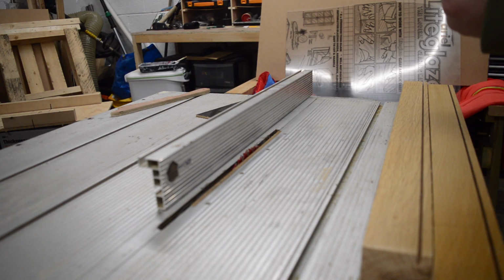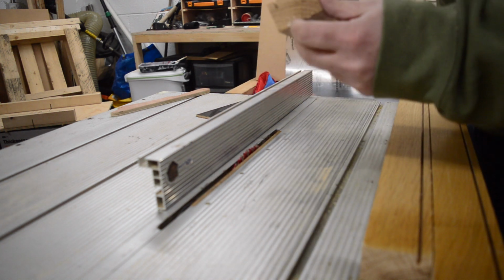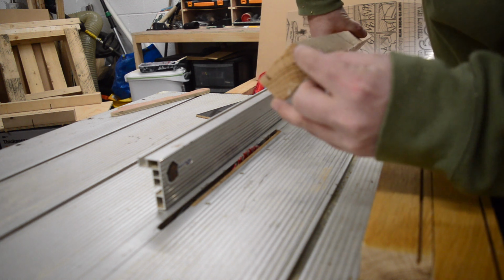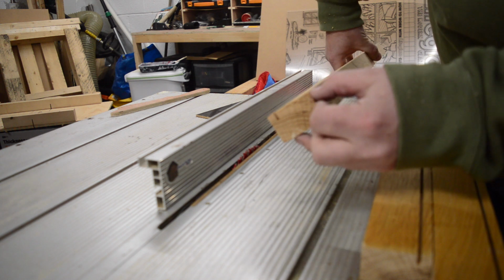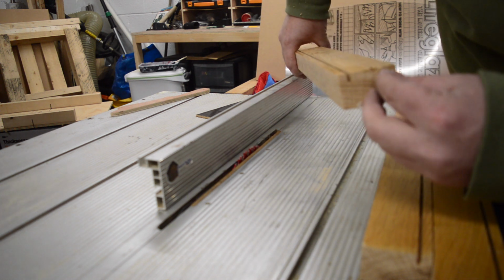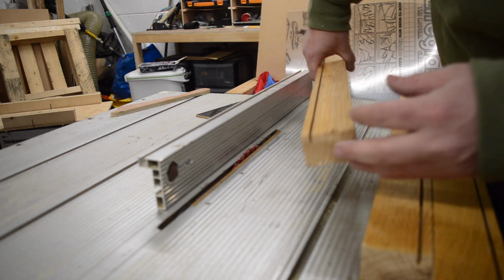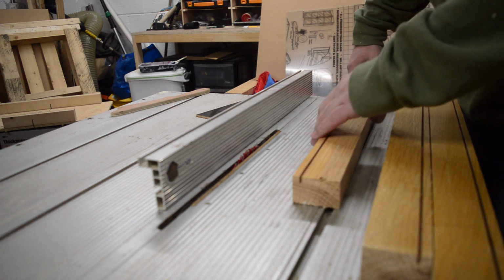So this is the channel where the backing board will go, so it's going to run down here. It's going to be a similar channel. I'm going to take a groove out. So the backing board for the medal sits in and it'll be pinned, held into place with some twist locks, and then it gives approximately this much room for the medals to sit behind the glass, because the medals protrude about 2.5 centimeters or so.